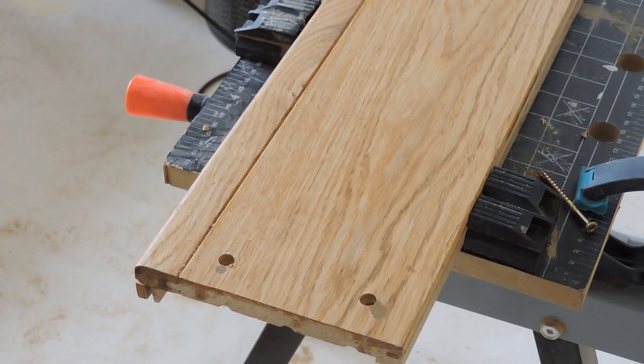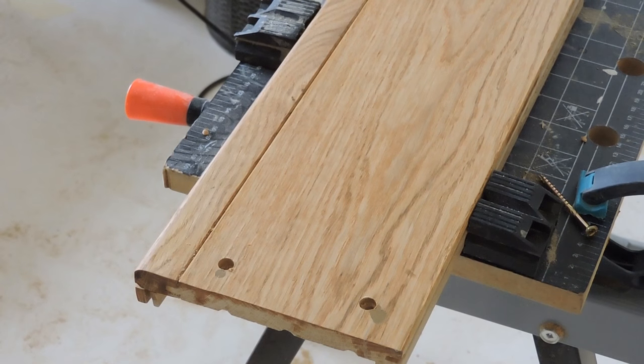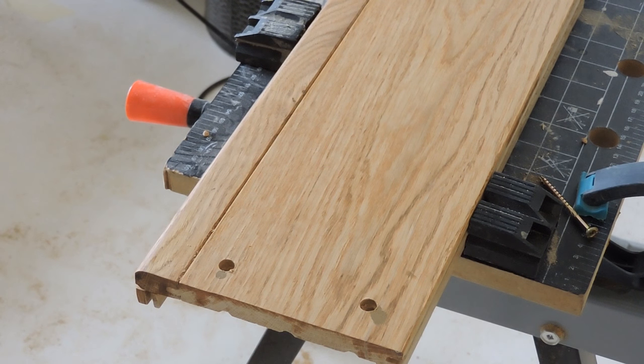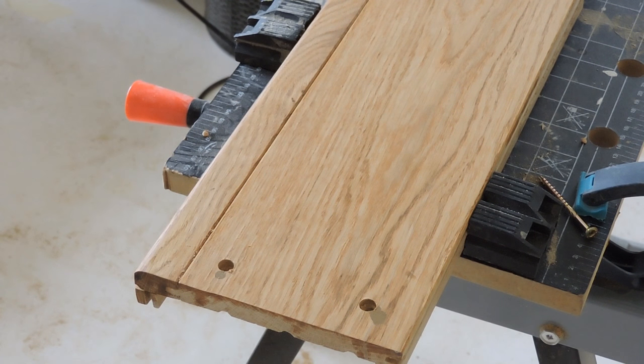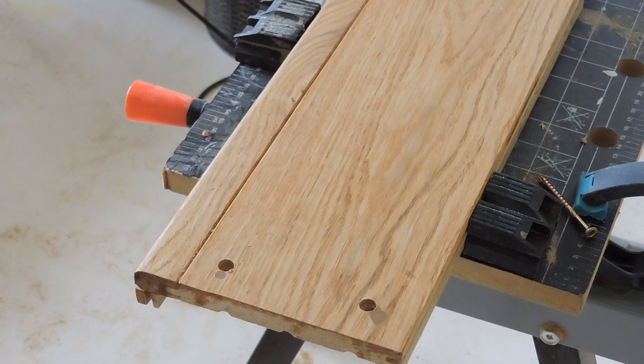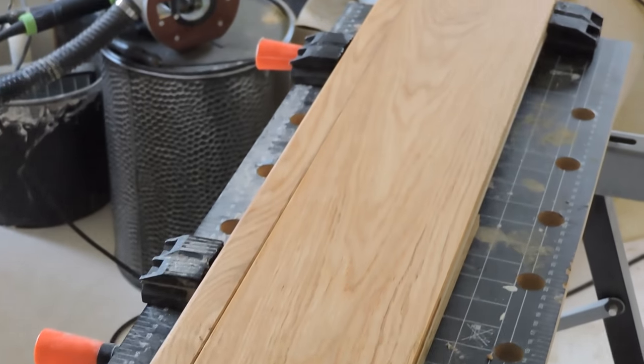So that I don't crack the board again, I did it right this time. I pre-bored with a 9mm wood bore that is just the size of the head of the screws, about 4 or 5 millimeters deep, and then bored all the way through with a 5mm. The screws are 4.5 millimeters by 60 millimeters long, and the heads are about 8.5 in diameter, so that they fit in the holes right. When I've got it screwed down, then I'll just put wood paste on and sand it, and when it's dry, I'll sand it again. I did the other side the same way.